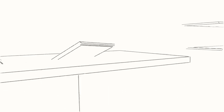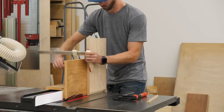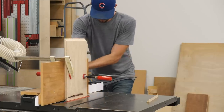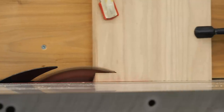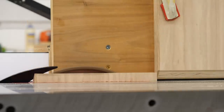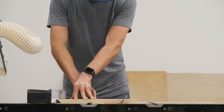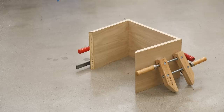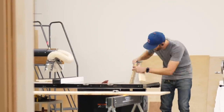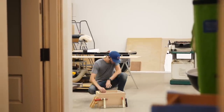One of the questions I always get is how do you determine how long each piece should be. The way I like to do it is to start by cutting my top piece. This one gets cut vertically on each edge, so I have the least control over refining the length. Once I have that done, I cut one edge along the top of each side piece, also vertically. Then I can make the rest of the cuts with the workpiece flat on the table. I finish off the two side pieces by cutting the bevels along the bottom edges, using the fence to set whatever length I want. Then I dry-fit the top and two side pieces and take a measurement to determine how long the bottom piece needs to be, sneaking up on the final length by cutting slightly oversized and nibbling away — usually takes three or four times to nail it.